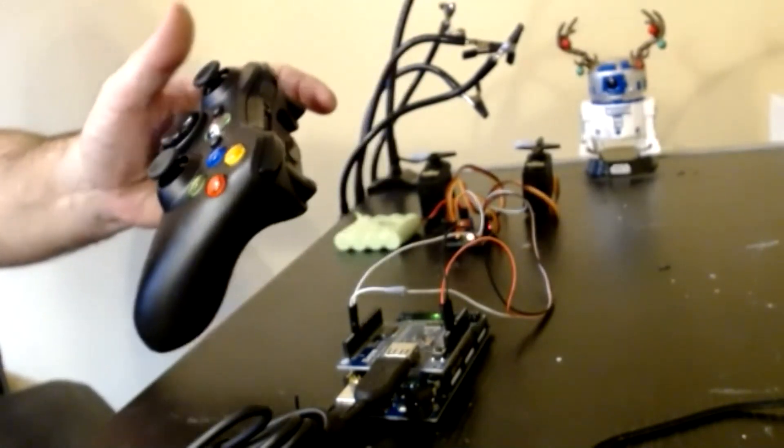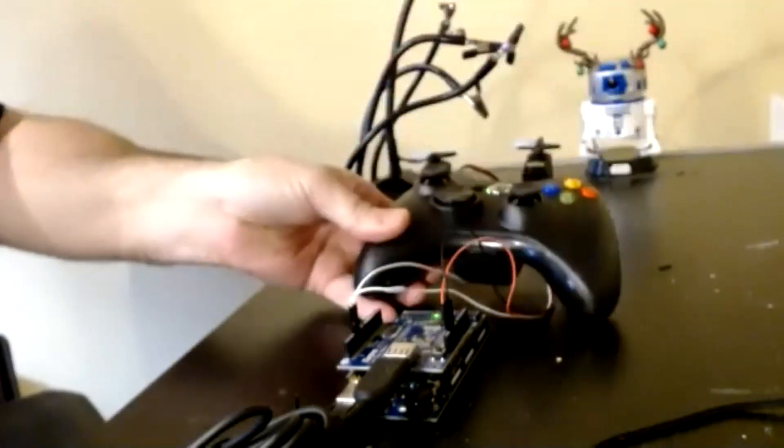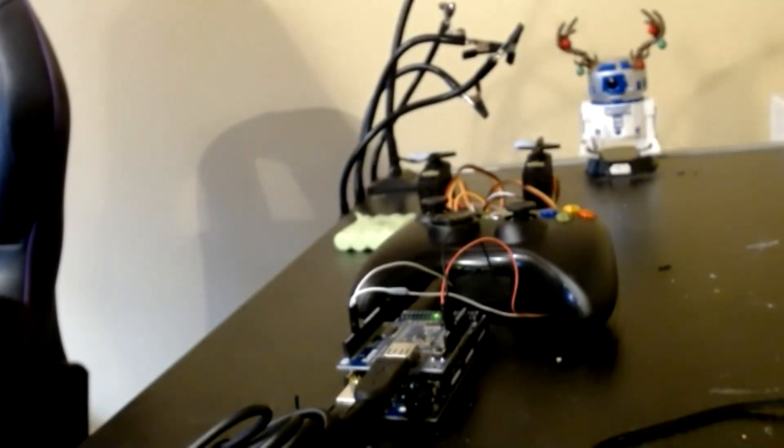Now I've got connection. The easiest way to check it on the example sketch is to push the button at the back, which gives you the rumble - I'm getting the rumble. Then if I push the Up key, it's running script zero, and if I press the Down key it's running the other script. The servos run in opposite directions on one script and in parallel on the other. And that's pretty much it - that's how it works. When you want to add these things to your existing build, go through that step by step and you can easily inject that code wherever you need.